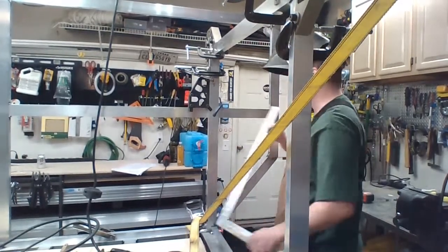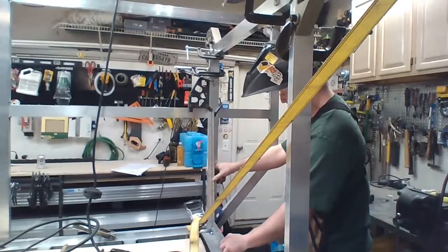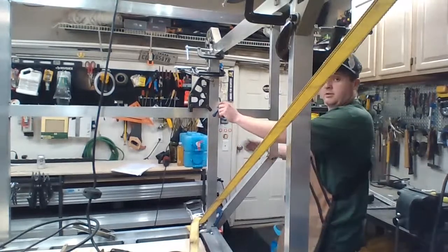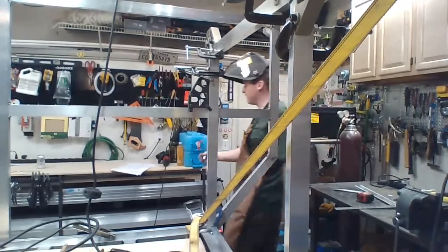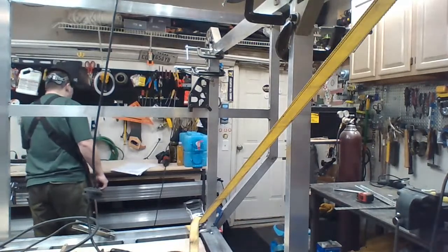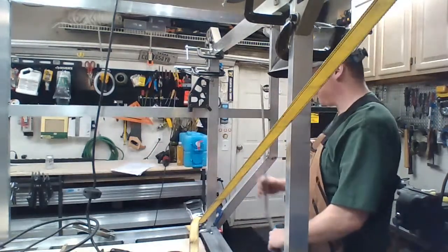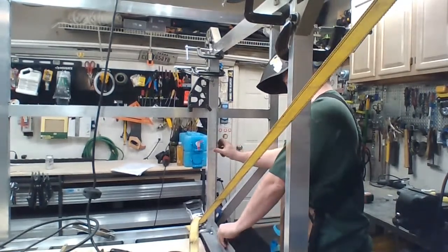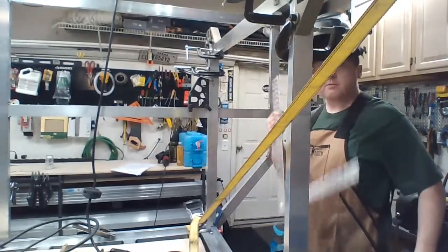So we've actually overcorrected. The challenge is, do we overcorrect? I can't, well, shouldn't. And I can actually get rid of this blue point because it's welded right there. So I'm going to measure off of the 1x2 going vertical. That would be more resistant to bowing. Oh shoot, that's good. I think we're just a 16th off. So I'll weld the bottom, weld the top.